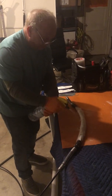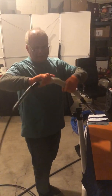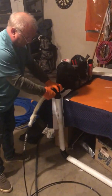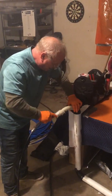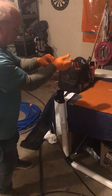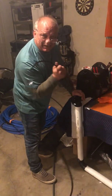Because this is pre-impregnated resin, you can put lubrication on it — it's not going to hurt the resin, it's not going to stop the cure. When you've got it ready and as small as you can get, we're going to go in through the side, which is the equivalent of a 2-inch clean-out that would be in the wall. As you can see, you can push it into place. Then, assuming you've gone down with your camera, you know the length that you're going down to.